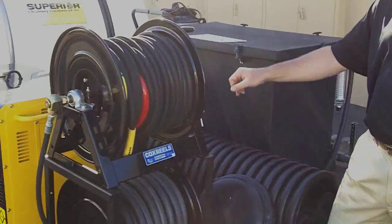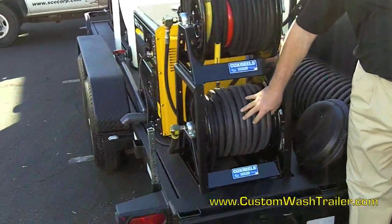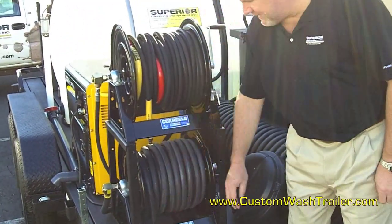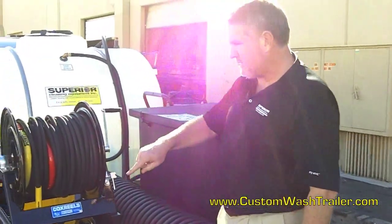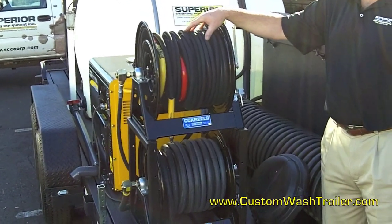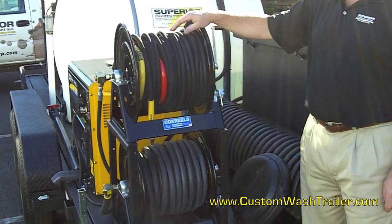You've got your high pressure hose reel stacked on top of your water supply reel. Here we put 100 feet of Goodyear Plyovic hose with extra heavy duty fittings on it, 5/8 inch, so we've got good water supply going to the 500 gallon tank, and we plumbed a jumper hose to that. We've also got 200 feet of R2 5800 PSI Landa hose with the extra long, UL certified hose guards on them.